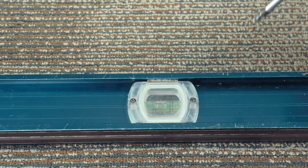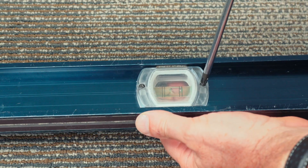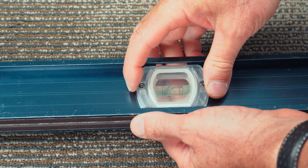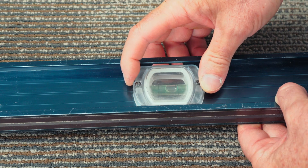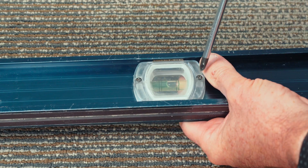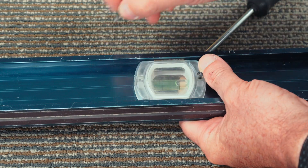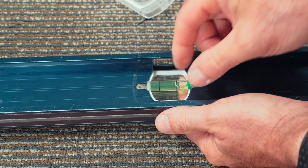On a level like this, this is actually your best case scenario. This one is adjustable and you don't have to modify anything to make it work. All you have to do is loosen these screws and this will rock back and forth. I know it doesn't look like much, but when you're trying to calibrate it, it is a lot. If that doesn't work, just take this apart — maybe there's some crud in there, maybe it was used to screed concrete.